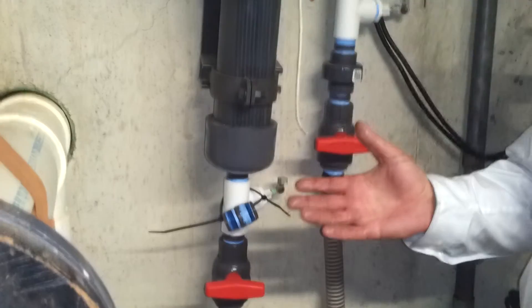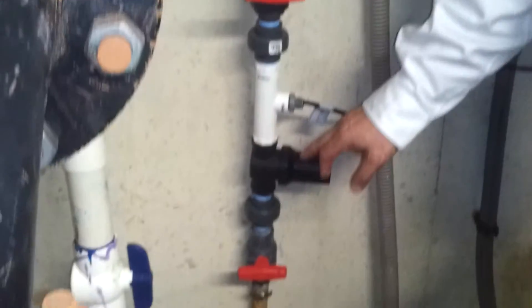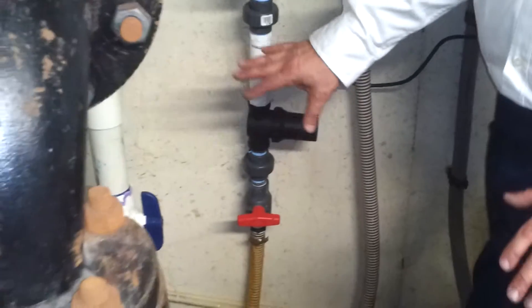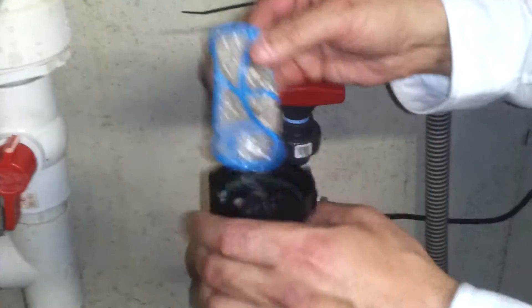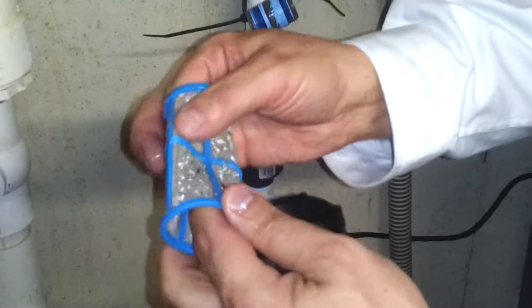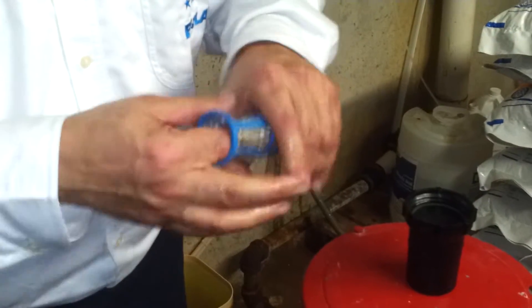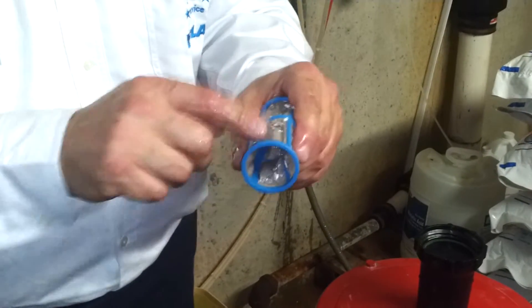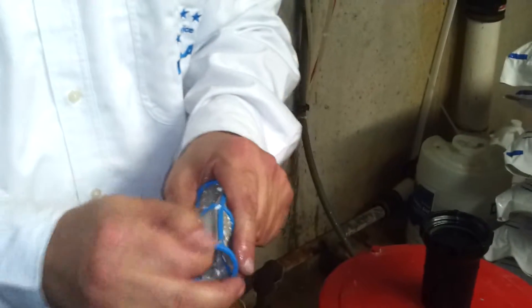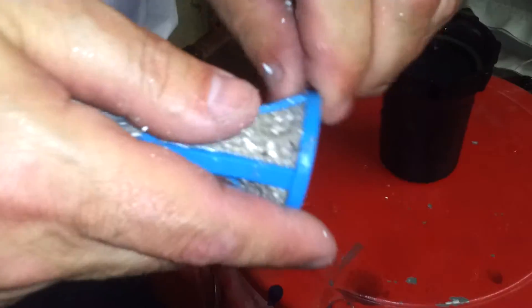You can shut off all three valves if you like, but we only really need to turn these two valves off to get to this strainer. This valve turns off the water coming from the pool — the sample that's coming from the pool. This one turns the valve off to the chlorine stack so that it doesn't rush back down on you. Then you just unscrew the inline strainer. Check inside — this one has collapsed in upon itself because there's so much debris in it. The plastic will bend back into shape. Over at your sink by the laundry machines there's typically a toothbrush you can use to scrub that screen out. When there's this much debris on the filter, that can affect the conversion stack, which is why we should clean these out once a week.